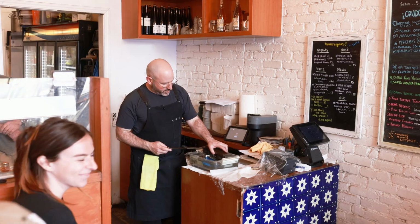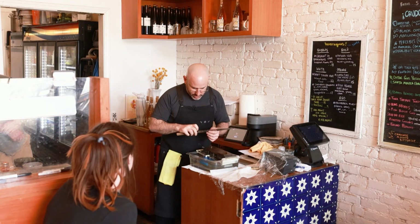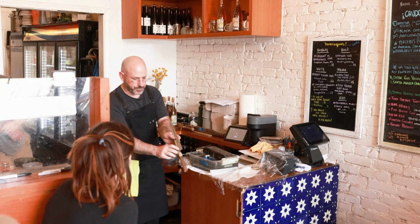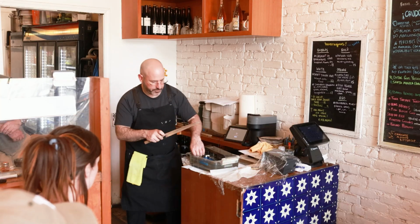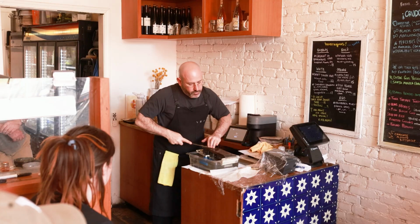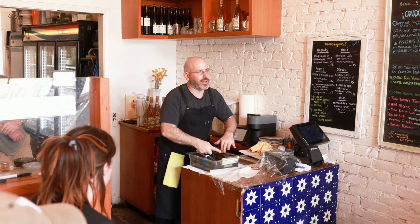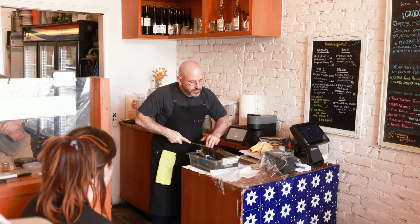Cool. So now I'm on the right side. Same thing. I'm looking at the scratch pattern here so we can see how different it is as we go. It's much more pronounced on wide bevels. You'll really be able to see it cleanly. And the sound is different too. Finishing stones don't make a lot of noise. Coarser stones make a ton of noise. Medium grit stones are somewhere in the middle.